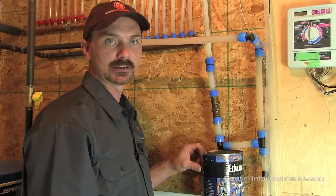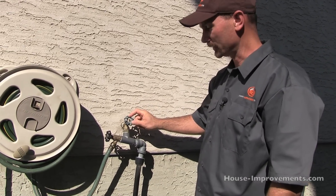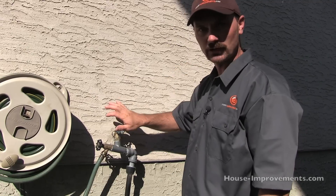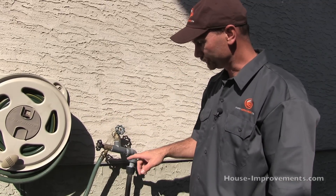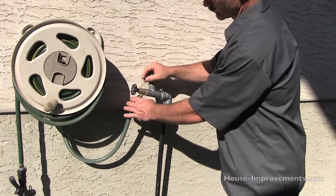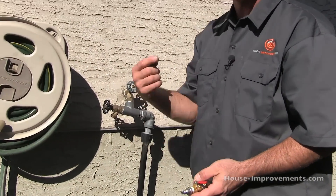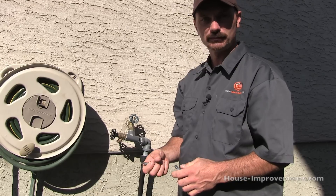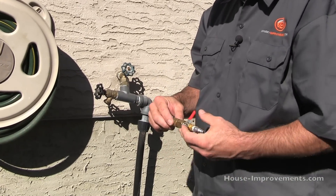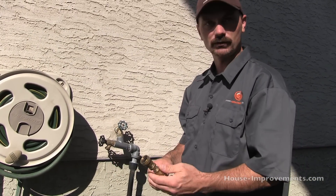Once we have that complete, we're going to go outside and do our actual blowout. Here's the other end of that line that we just drained. I'll close this valve back up again so we're not pressurizing that system into the house — we will open it back up when we're all done. Now, I did state before that really all you needed was a compressor. That might have been a little misleading. You need a compressor, enough air hose to get over here, and possibly some type of fittings to attach to your sprinkler system. If you've had people blowing your system out before, there may even be a setup there already — you just have to get the right kind of adapter.